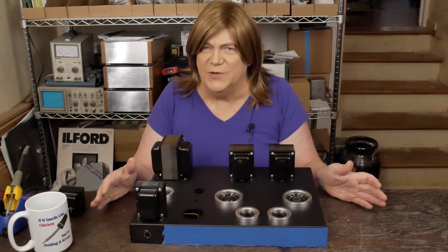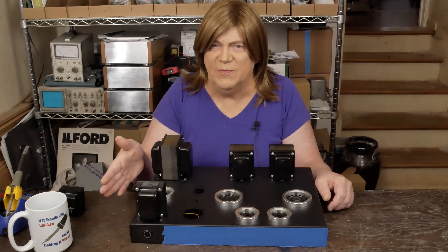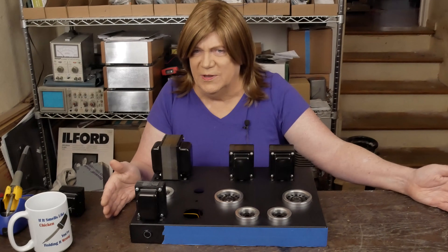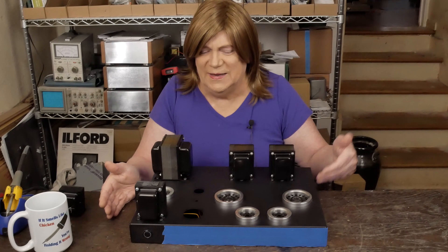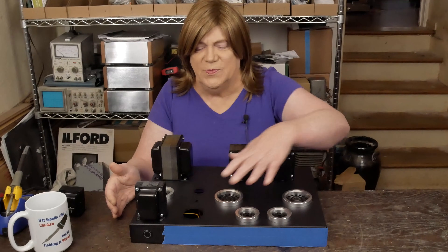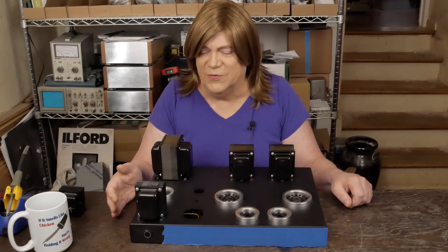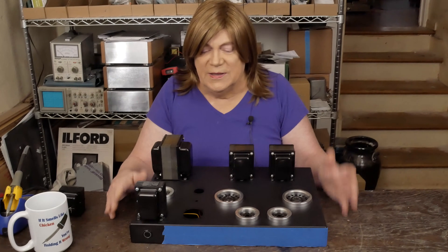Hopefully that was enough to see what's going on with this amp and how to build one. We did a very step-by-step build of my other budget 300B, which ended up not being that budget by the time you add up all the parts. This build is trying to hit a lower price point, so if you go watch those videos they'll give you a lot of clues about wiring up the front end — most of that is the same. The only real difference is the power supply.